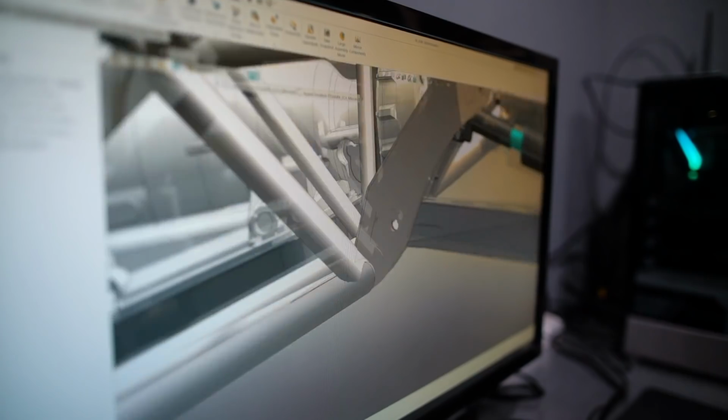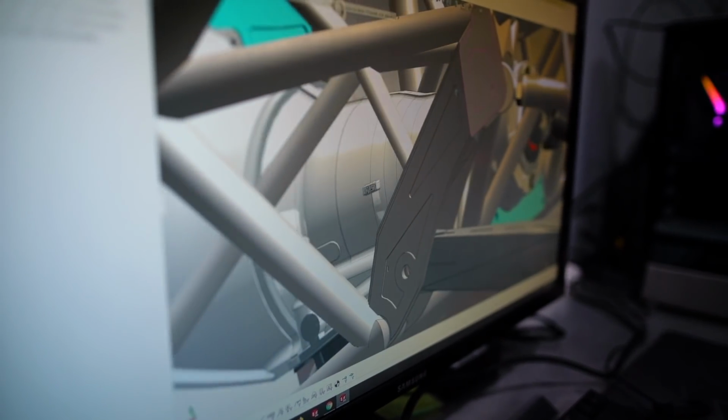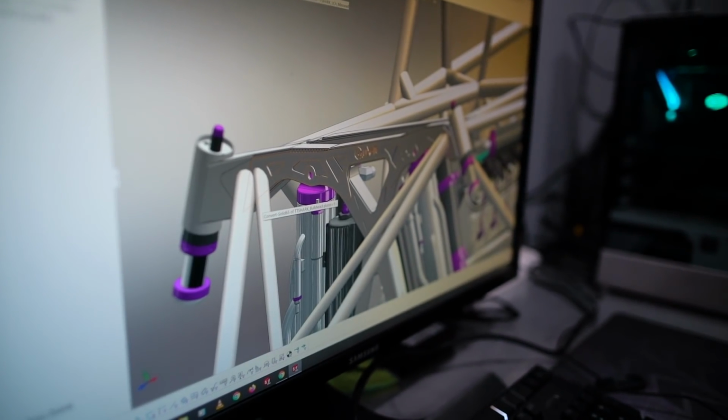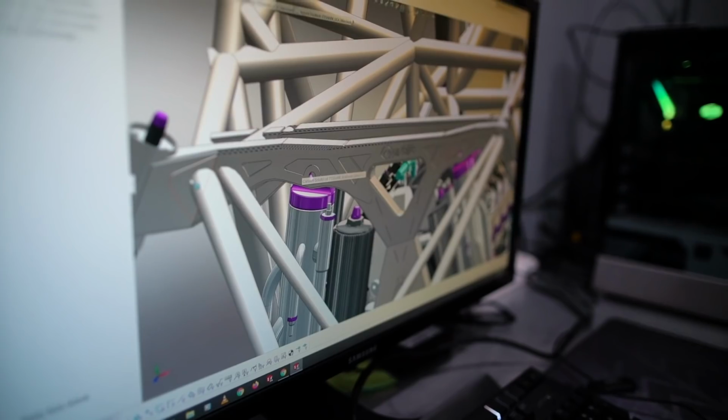Overlays, these overlays that are on the bulkhead and also on the rear pivot boxes, these are just beautiful. It does create a lot of extra welding, but it's just so stylish, and it actually does perform a function. Yeah, and the advantage of doing the overlays is you can start off with lighter plate work, but when you double it up, you can add strength to the areas that you really need it, and then not add the extra weight where you don't need it. So it gives you a little bit more flexibility with the design. Instead of just running 1/4 inch plate on the whole design, we can do 1/8 inch plate and then double it up where we really need that extra strength and save some weight that way, and looks a lot cooler too.